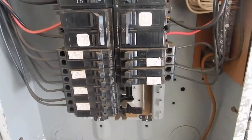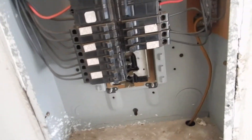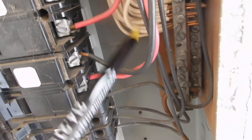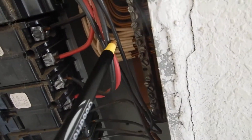Since this is the main cabinet and main disconnect, it's okay to put your neutrals and grounds together here. These neutrals with the white carry current continuously — these are emergency conductors. You can double-lug the grounds, but you should not double-lug your neutrals. One wire, one screw — just like over here, one wire one screw — because these are continuations of individual circuits. We've got double-lugged neutrals in here.